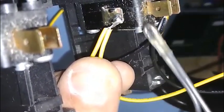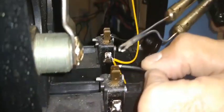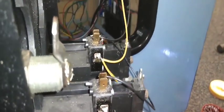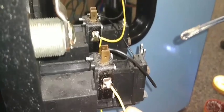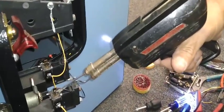Got to give it a second to set up. Same thing again on this side — just jumping from this one to there, from one switch over to the other. It's not that hard — they'll all be connected. So we'll fuse the negative and the positive, and now the other one on the other side. I'm learning a lot here. Okay, I'll teach you something I learned the hard way: use this kind of soldering gun and get it hot first before you touch it on there. Don't leave it on here waiting for it to get hot, because you're also heating that terminal up — you'll melt your switch inside before the thing is even hot. So get the gun hot first and then put it on. Awesome.